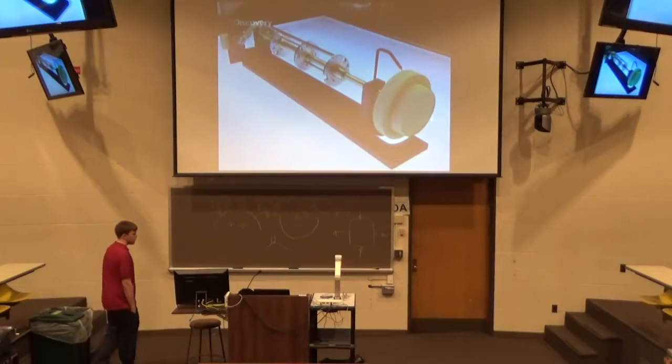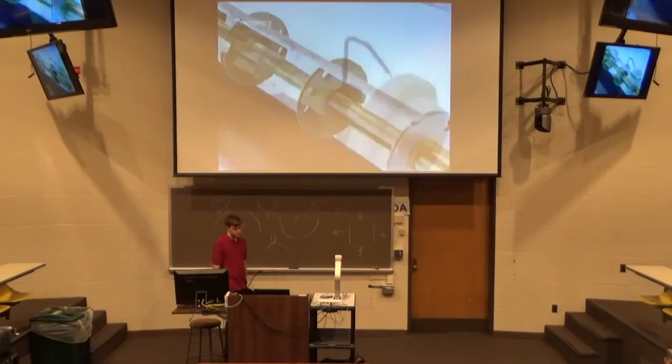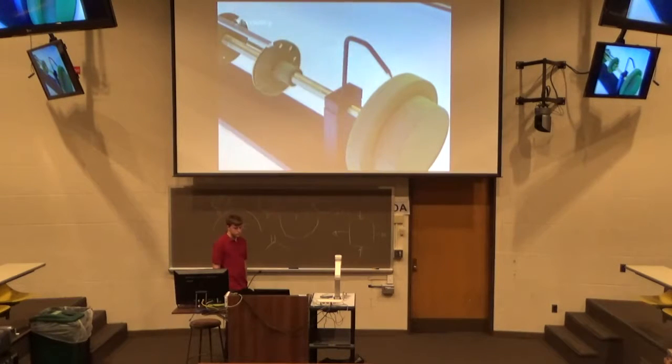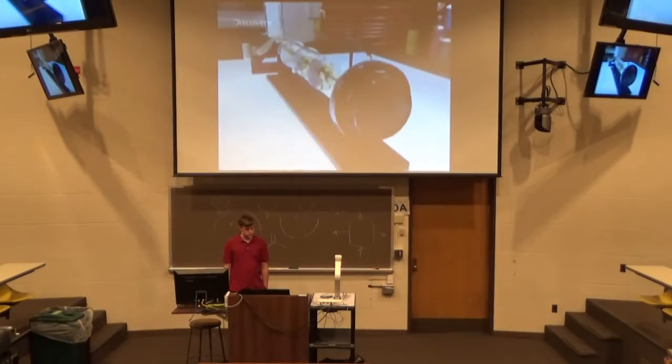A tooth on the small wheel turns the third wheel, which has its own tooth. That tooth turns the second wheel, which eventually moves the first wheel. The first number in the combination corresponds to the position of the first wheel when its notch is right at the top, directly under the fence. There is one chance in 99 that someone will be able to randomly find that position, because there are 99 possible choices.